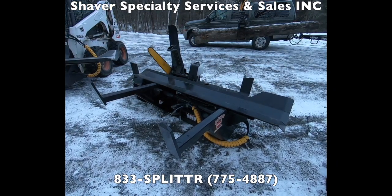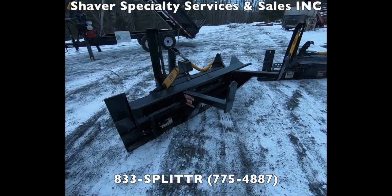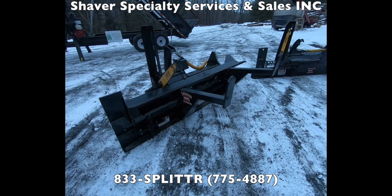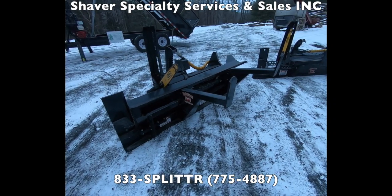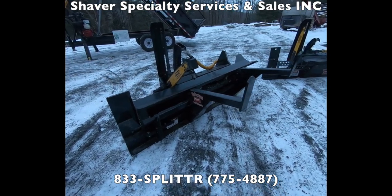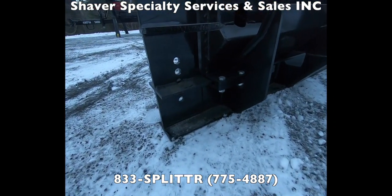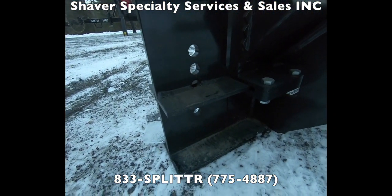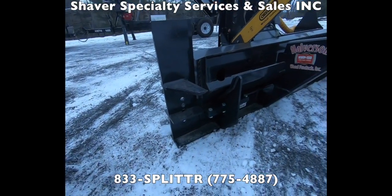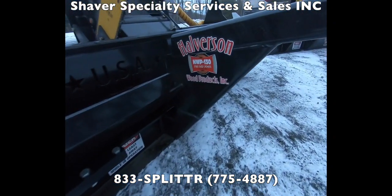And next we'll show you the 130. This is the 130. As I said earlier in the introduction, I believe this is the last known new 130 in the US. We had this in inventory from last year. This does have a fixed four-way on it. Even though you see the holes, they are welded fast inside the I-beam. It's just using the same common adjustable wedge from the 140 machines, but this one is welded in there fast, so it is a fixed four-way.